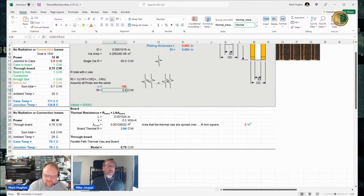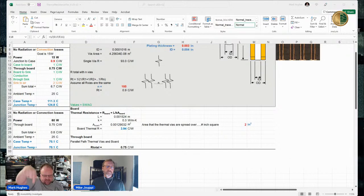Now, talking about thermal vias — I want to get back to what's practical from both a manufacturing and electrical background. What's practical for getting a population of say 100 thermal vias at 10 mil diameter in a particular area? Well, in two square inches it's doable, but you start running into upcharges. Anytime you have a drill hit, that drill can sometimes wander and twist, so you can't always stack them right next to each other — you've got to put some separation distance in. Typically you don't want an aspect ratio greater than 10 to 1.